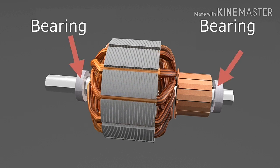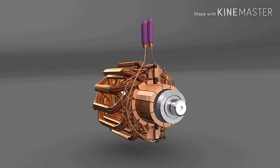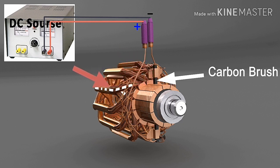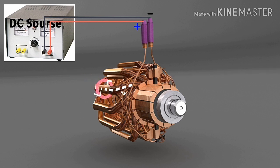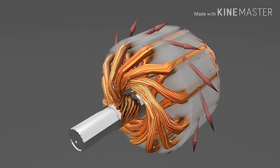This complete assembly is housed over a cylindrical shaft made up of high-quality steel. Because of the bearings at both sides of the shaft, the rotor is capable of rotating between the field poles. When electric current is forced to pass through the rotor conductors by a set of carbon brushes through commutator segments, it creates their own magnetic field, which tries to distort the magnetic field created by the field poles. Due to the interaction between two magnetic fields, electromagnetic forces act on the rotor conductors and these forces act tangentially on the rotor surface.